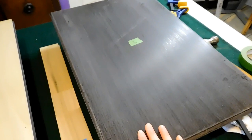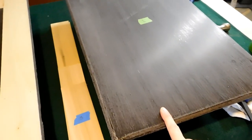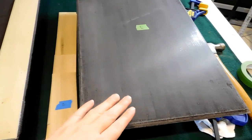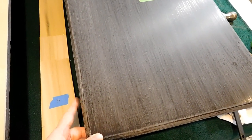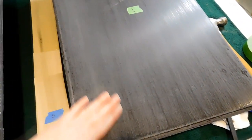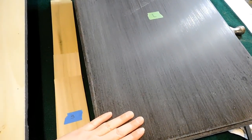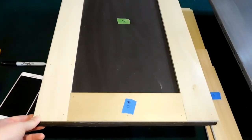I've done six doors today. After I finish this one I'm going to stop for the day and hopefully get the remaining 11 done before the end of the week. One thing really fast: if your doors already have a clear coat or glossy paint on them, you will have to sand your doors. Always go with the grain of the wood, because otherwise it leaves scratch marks that can show up on the finished paint project.